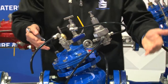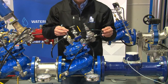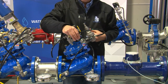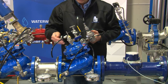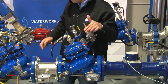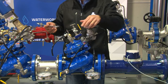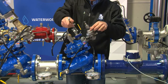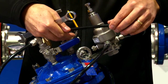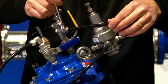For demonstrating purposes, the inlet, outlet, and bonnet valves have a yellow handle — yellow handle valves are normally open. The flushing ball valve used to remove air off the cover is blue, identifying it as normally closed. If you don't have a flushing ball valve on the cover, the alternative is to go to the highest point in the control line — immediately downstream of the cover — slowly relax the fitting and wriggle the tube until all air comes out. When water drips from the valve and the milky water is gone, tighten the fitting and the valve is ready for operation.